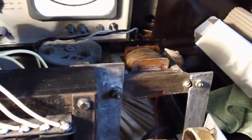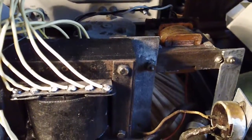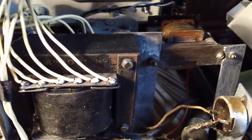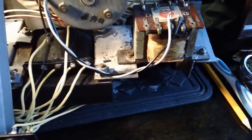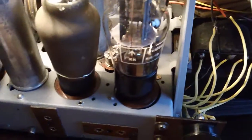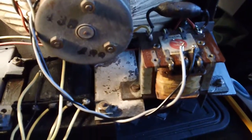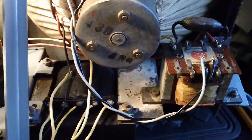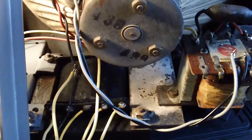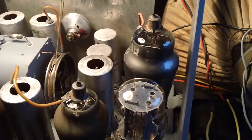Just a little word of advice: if you do this and you're working with an old radio and you've just tested it and then you're switching it off, unplugging it from the mains and prodding it around - do not touch the output transformer tags with your fingers, because they're connected through to the large electrolytic capacitors under the chassis. I've touched one before and got a nasty zap through my thumb. It didn't cause any damage, but pulling your hand away quickly could catch it on a solder tag and leave a cut.